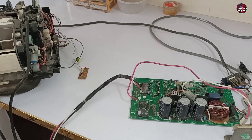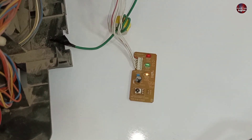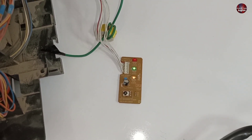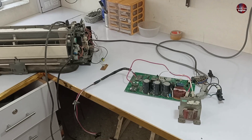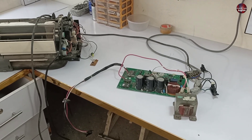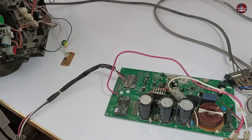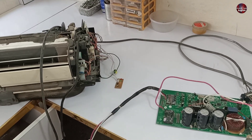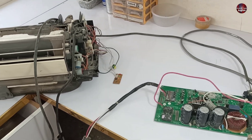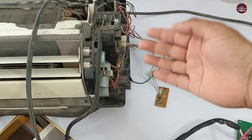I will show you what is written on the indoor motherboard, but you can also identify it through its blinking pattern. The green and red lights are blinking one time, and the orange is blinking continuously. When these lights blink in this pattern, it means there is a serial communication error. All air conditioning brands, whether inverters or DC inverters, show the serial communication error with a different error code. I will tell you how to fix it and what causes the serial communication error.